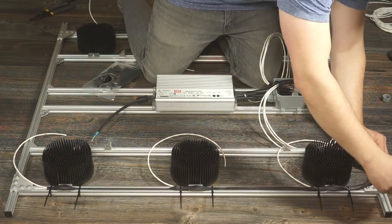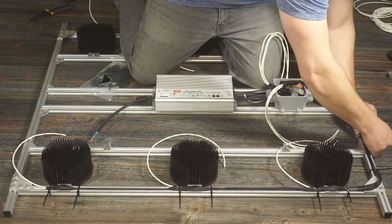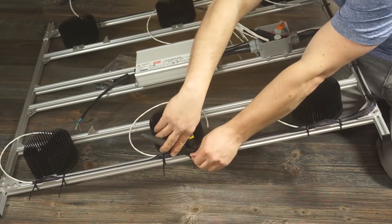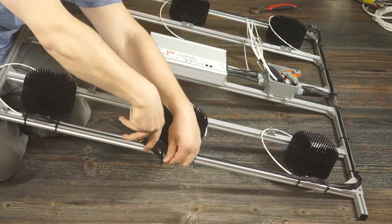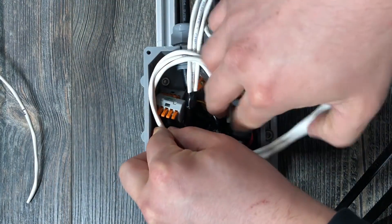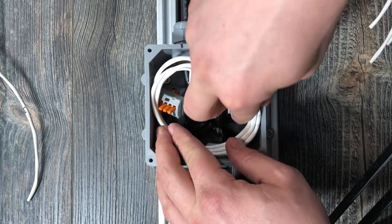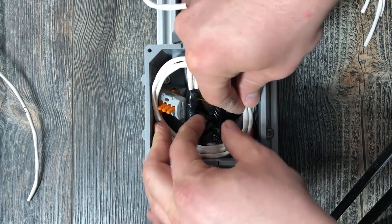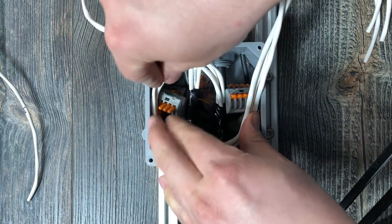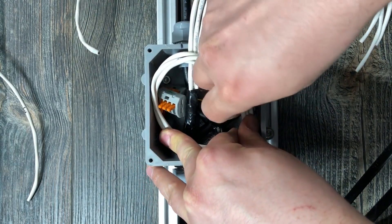To fasten the wire snake down to the rails, I used tie wraps. The cable bundle tucked nicely into the T-slots in the rail. In the splice box, I trimmed the sleeve back and taped it into place. I'm going to do a little service loop inside the box to relieve stress on the cable, and the extra cable will make it easier for me to test the current as well. I left the cable long to start with just to make testing easier, and then cut it down a little bit shorter when I was finished with my testing, and cleaned it up with some heat shrink.